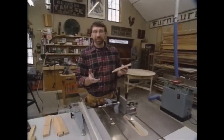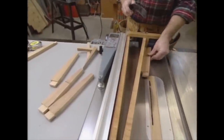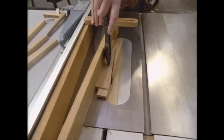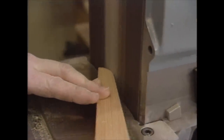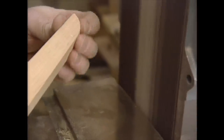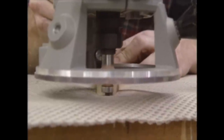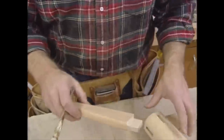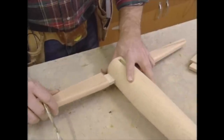I'm using the same techniques I used earlier to make the other tenons. I want to taper each of the spokes from the full width to about three-quarters of an inch, so I'm using my tapering jig — I set the piece against the stop and guide it through using a push stick. I'm using my sanding center to grind down a curve at the end of each spoke. Then I'm using my router with the three-eighths inch roundover bit to ease the edges of each spoke. There are no mechanical fasteners at all to put these spokes into the axle — just a little bit of glue and a nice tight fit.